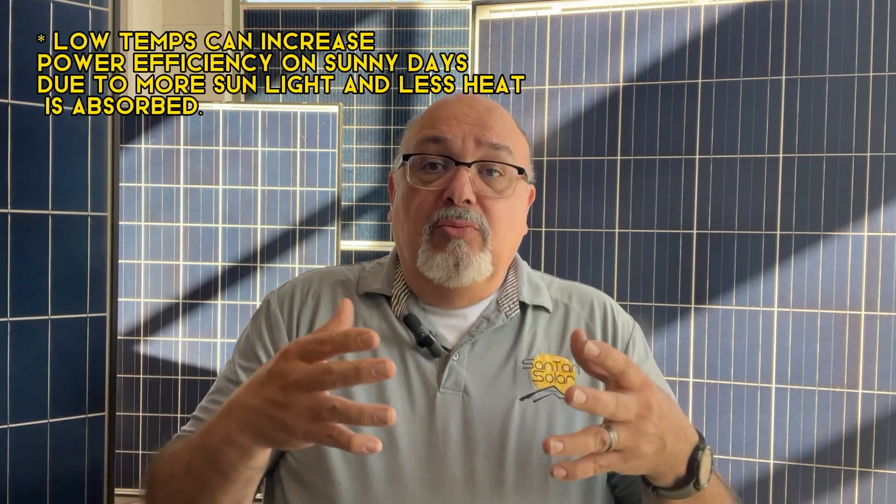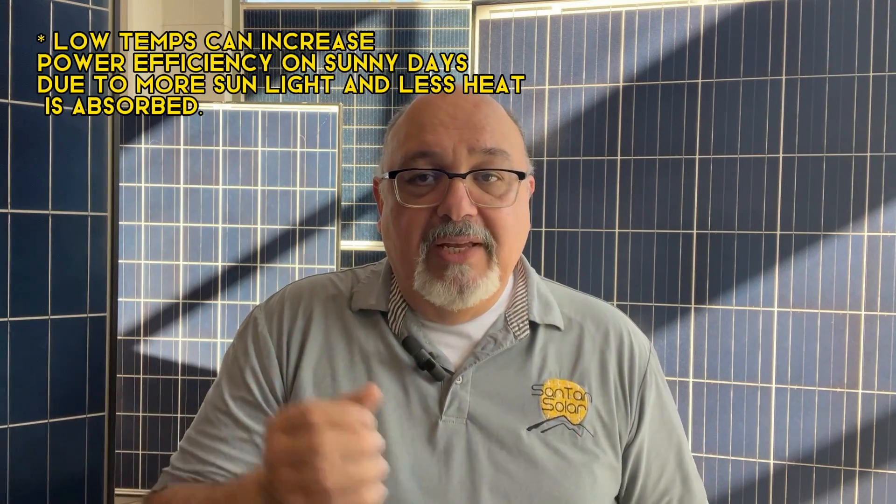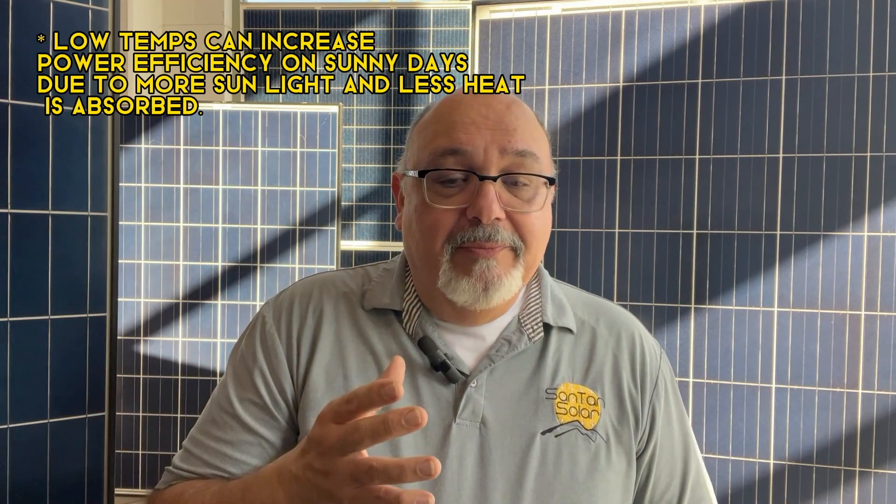When you start thinking about colder temperatures — like up north or someplace with higher altitudes — you generally have much colder temperatures during the winter. Wintertime means you're going to be producing at around 40 degrees or so. You have to consider that when panels get colder, they produce more. However, during wintertime you get fewer daylight hours, so you don't have as much time for the solar panels to accumulate those daylight hours. But because they're producing at higher efficiency due to the cold temperatures, again you have a trade-off. In colder temperatures, solar panels can actually thrive because they'll produce more power.